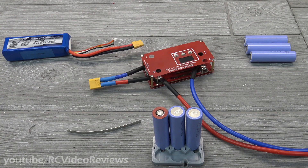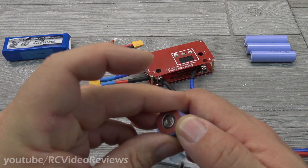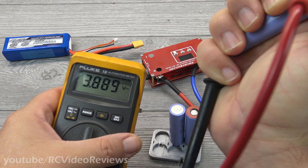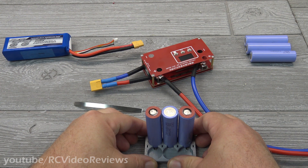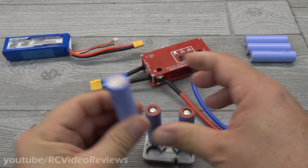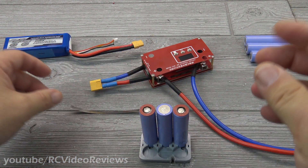Let's get started. The easiest way for me to think about wiring is to think about what I want in series first. In series, you're connecting the positive to the negative. I want a 3S battery at about 12 volts, so I'll take three cells and connect them in series. I have these cells at a storage voltage of 3.8 volts per cell, and at my fully charged rate of 4.15 volts per cell I'll get 12.5 volts pack voltage. I'll start with the series connections — taking the negative lead of one battery and connecting it to the positive lead of the next, then repeating that process.